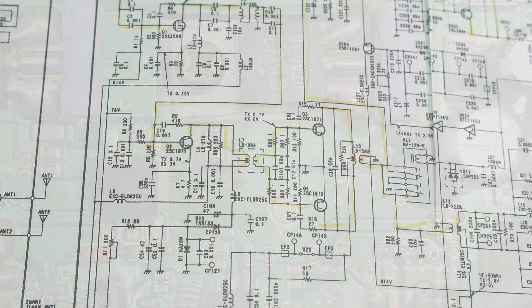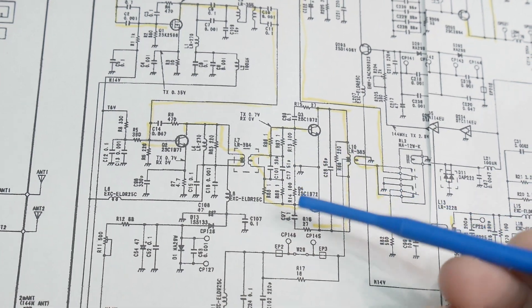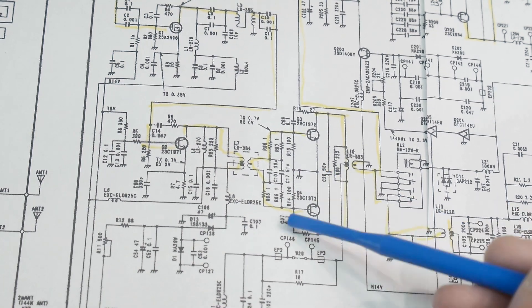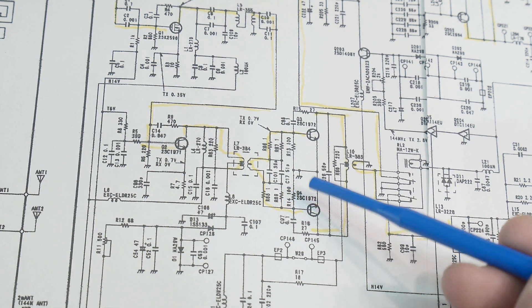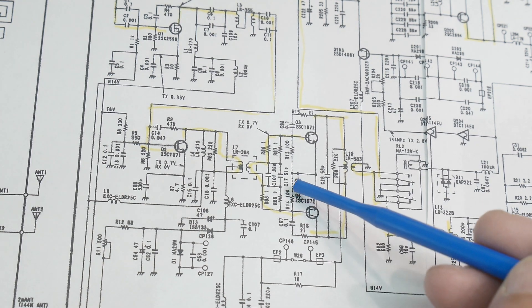So now that we know that there is a dead resistor that got blazingly hot — it is this resistor right here. It's the resistor that pulls the emitter down to ground. And the resistor that was toasty was a 47 ohm. The schematic shows 100 ohm, so I don't know if they've changed that. And the other side is a 47 ohm.